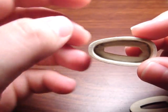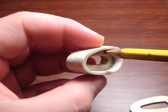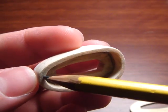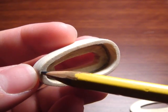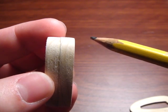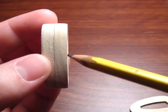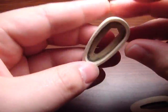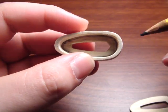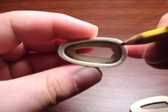The reason for that is that once your Tsuka is in place, it's only going to be as big as this inside recess — it's not going to be flush with the outside edge. So you've got this overlap, and your Ito is actually going to take up that overlap, so when you're looking at it, you're not going to see a gap between here and your Ito. You'll just see one nice line over the top and the same down here, which makes a nice flush look. So you need to know the thickness of your Ito — I can't give you a fixed dimension for this border because I don't know what you're using. Just stretch your Ito out a little bit, get a dimension, and that's how thick this is going to be.